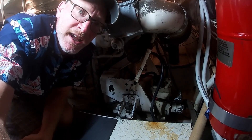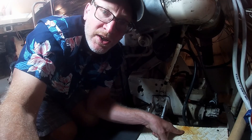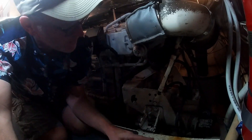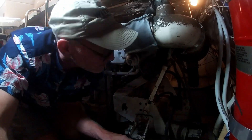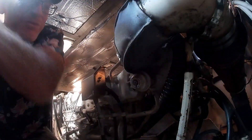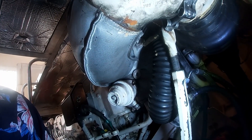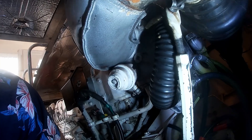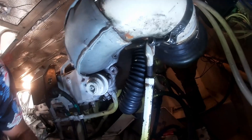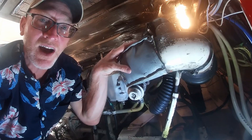During engine checks this morning, I discovered a rusty water stain from our moderately long three-and-a-half-hour run yesterday. I've tracked this down to leaking from right here, which is up underneath our exhaust elbow. We've got a little bit of a rusty salt water, raw water leak. So the job now is to remove this insulation and see what we've got here.